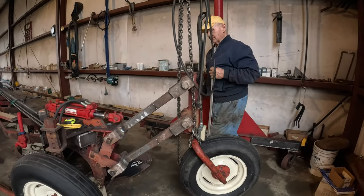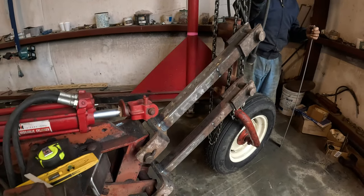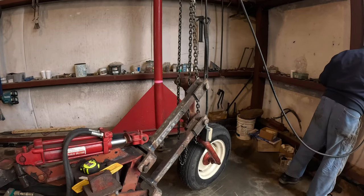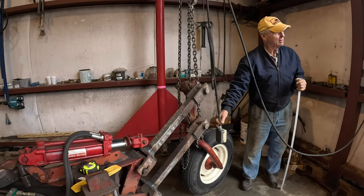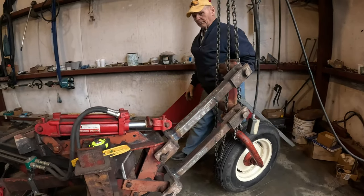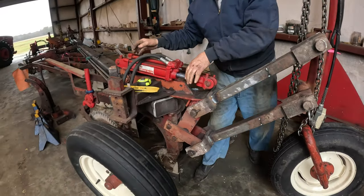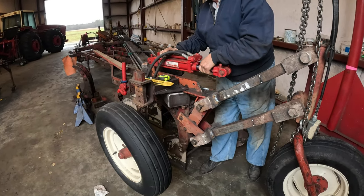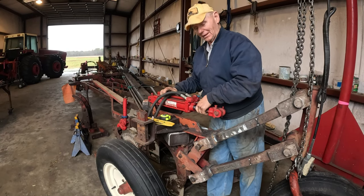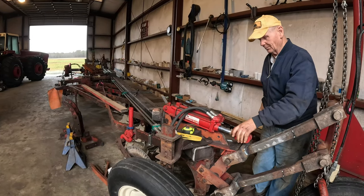We worked on that today and got all this done. This is completely finished, and I reckon I can show you a little bit of action. The plow was kicking over, trying to lift out of the ground. It won't lift the plow — and here's why: the weight of the plow was on the gauge wheel. When it's hooked up and moving, it doesn't pick up until it hits right there, and this thing is fully retracted, so it was open like that. It won't pick — it's not picking the plow up in that condition.